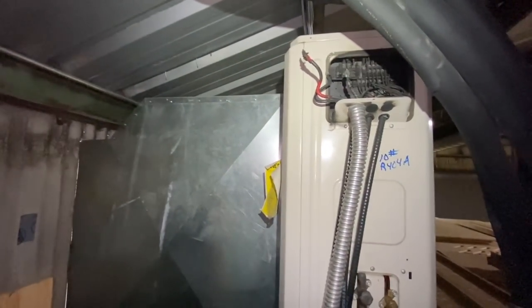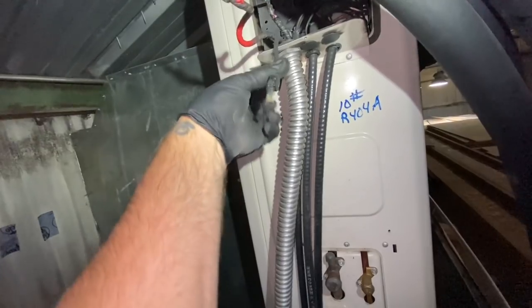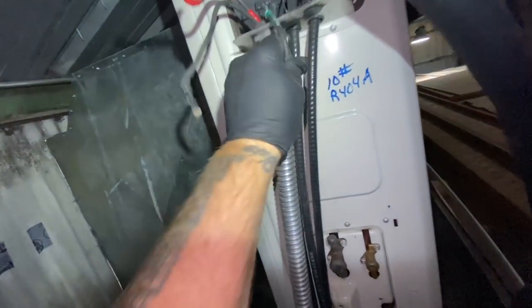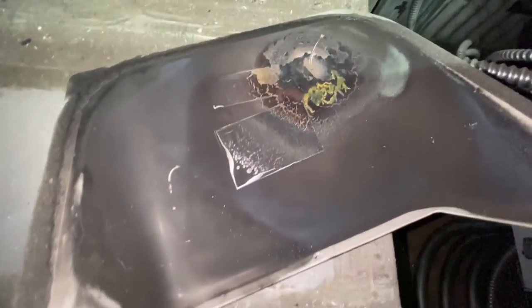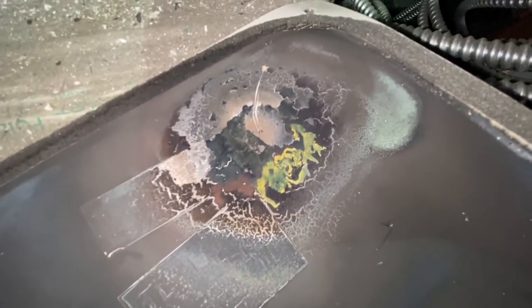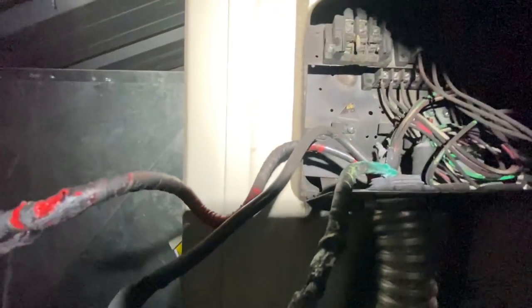What I can do is cut these back, reset the breaker and see if I have proper voltage. This is single phase. This one was wrapped in green wire to be a ground right here, and these two are the hot — hot, hot, ground up top there. See where it hit inside the cover? It was just making an arc welder. I'm going to take these two out and see if we can pull that whole terminal block down.